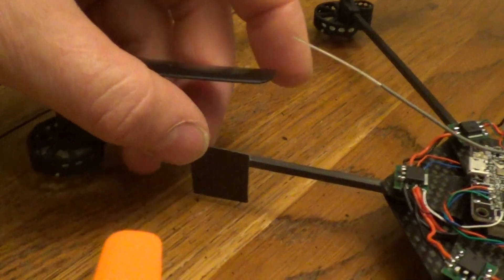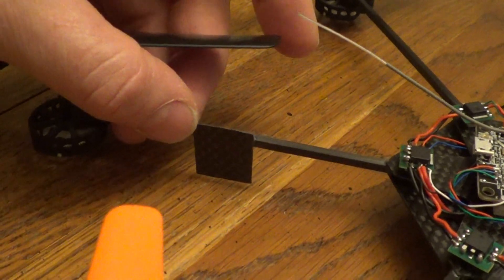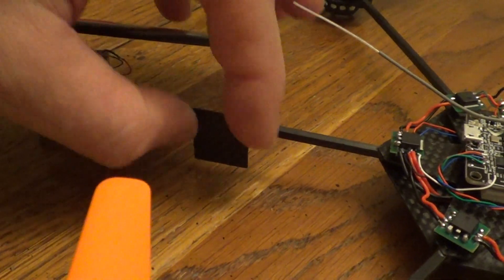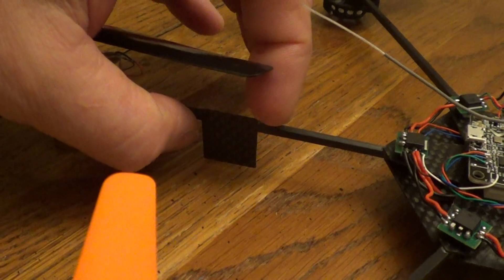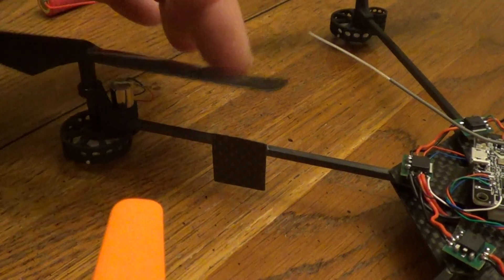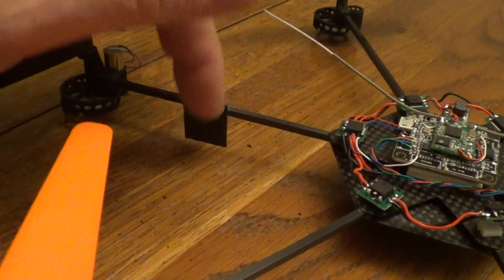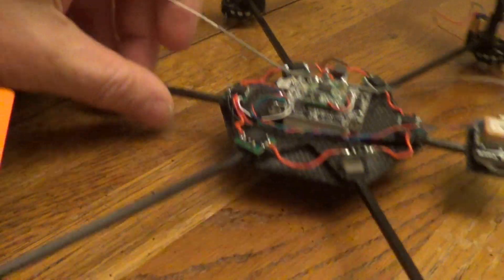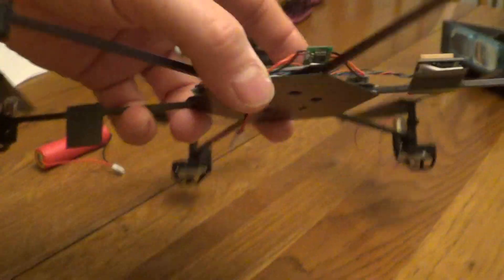My video transmitter — I'm going to do 250 milliwatts. The video transmitter will be right here in the air cooling stream, a real tiny little board, with a regular vertical linear-polarized antenna, so it'll stay nice and cool. The camera will be mounting up on the front, and I'm using a night-vision camera, which should be really cool.